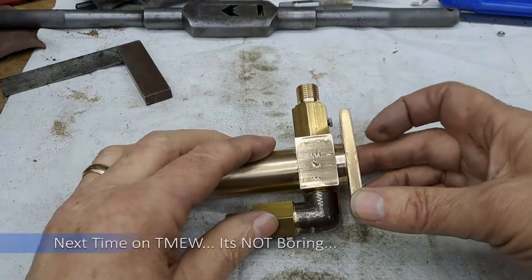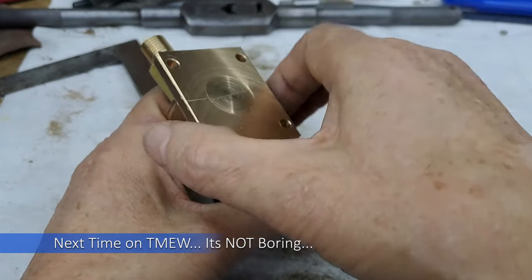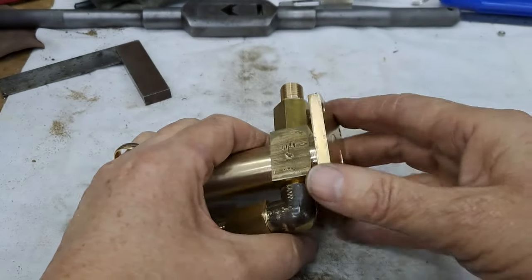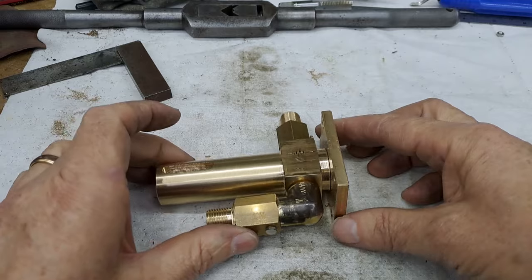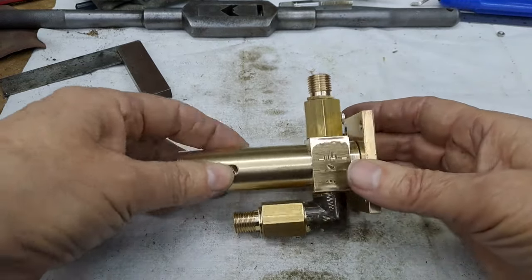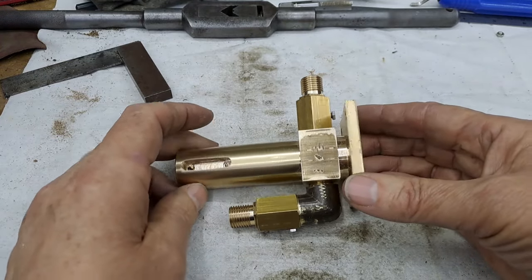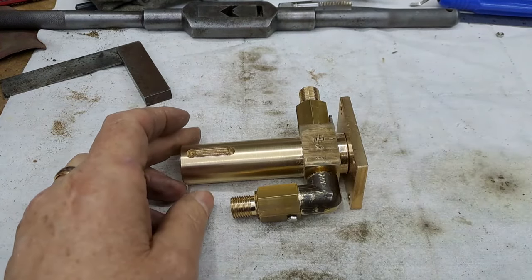Literally the bore through here, thread the end of that, the silver soldering of the flange on, of course, make the plug for that end. And then that's the piece made. We've already made the yoke, so we'll have to make the pump ram, which has a little slot in it for an O-ring. All right, guys, give us a tick. I'll be back in a second.